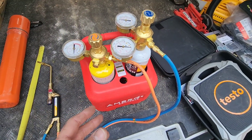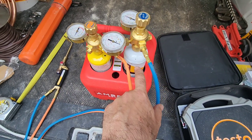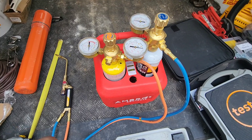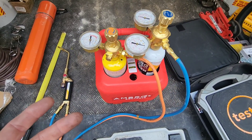Typically what you're going to get out of each cylinder is about three hours of use of MAP gas and about thirty minutes of use of your oxygen. Now if you're good with your torch — if you're good with getting your heat on and getting your heat off — you could probably do a few residential installs on one oxygen cylinder.